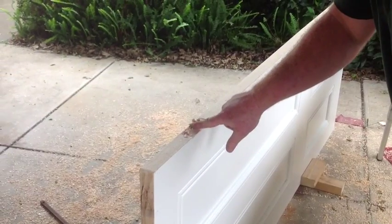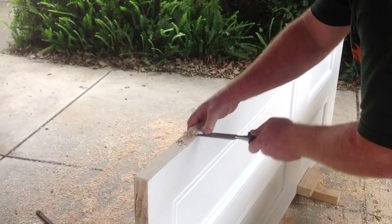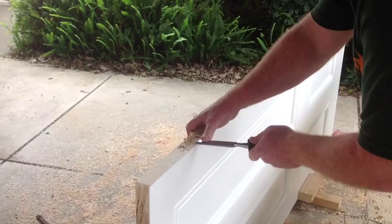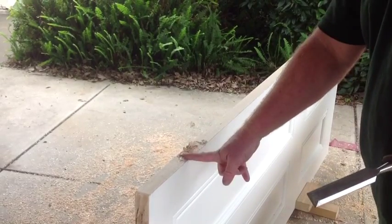So you can see all my down cuts there. Now I'm just, with the thumb, applying pressure there, and then just using the sharpness of the chisel to slice these chunks out. If you chisel in there, they shouldn't be too hard to remove. You shouldn't really have to reef it. If you do, either your chisel's blunt or you're not hitting in far enough.